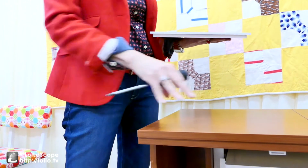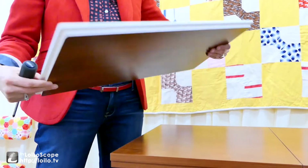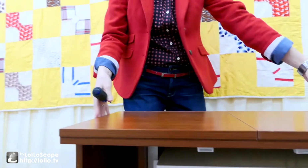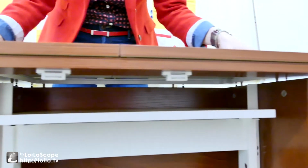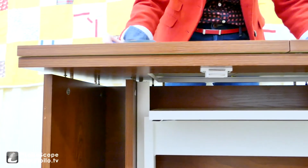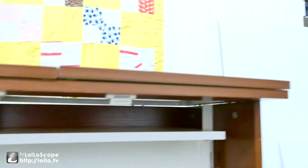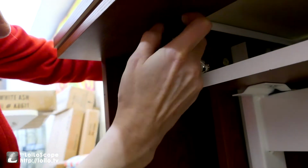For step 9, you're going to get your top panel A, and we do recommend first taking out the platform that's inside of there, but you're going to seat your panel A onto your X, your Y, and your Z and D panels. There are 8 total cam bolts that need to be locked down, so you're going to get it lined up, press it down, and then come over and tighten each of those, turning again 180 degrees. And again, with this, you want to watch your placement here. Make sure your magnets are facing in the front.